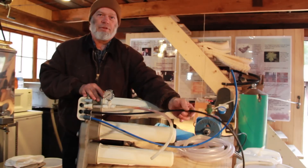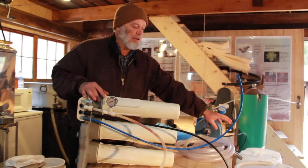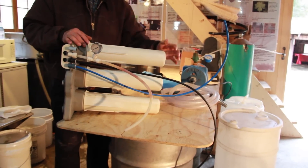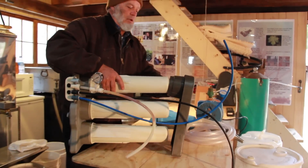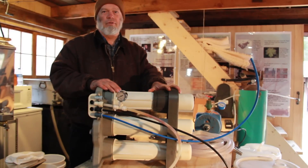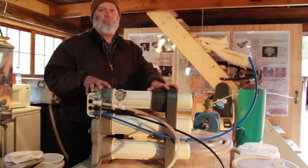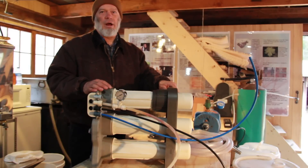Since I have two different things coming off of my RO, I need two different tanks. One will collect purified water and the other will collect slightly concentrated sap. The rating on a unit like this is 30 gallons of purified water per hour, but when I put sap against it rather than ordinary water, I get one sixth of that productivity — so this unit will take off somewhere between four and five gallons of purified water per hour.